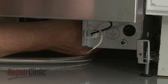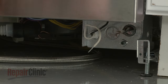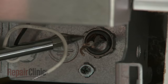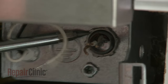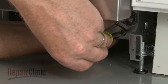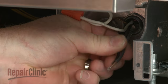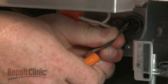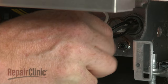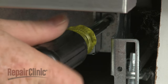Fully position the wire strain relief in the junction box and secure the strain relief nut. Reposition the grounding wire and tighten the screw to secure the retainer. Connect the wires using the wire nuts. Align the cover plate and replace the screw to secure.